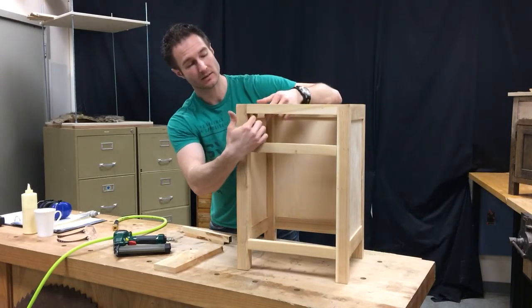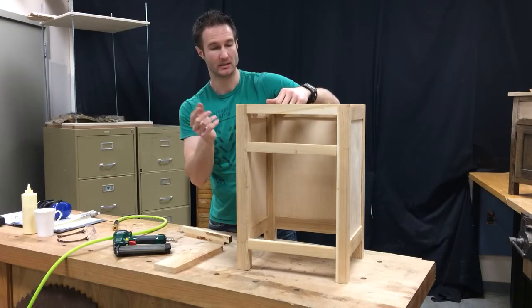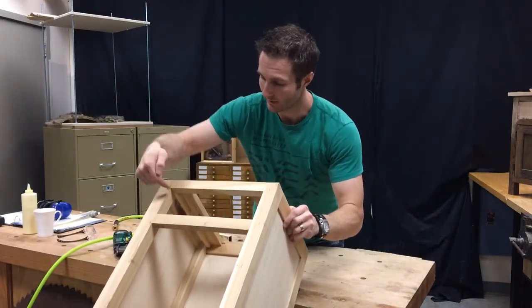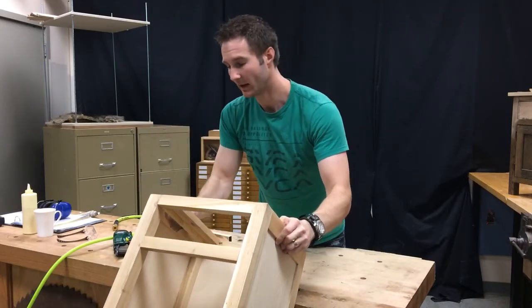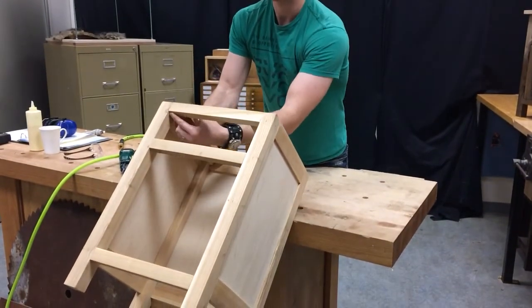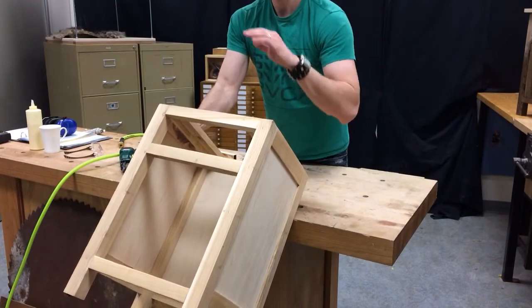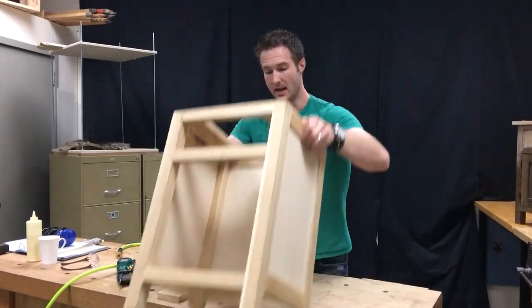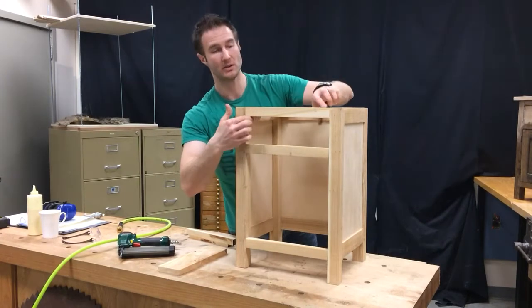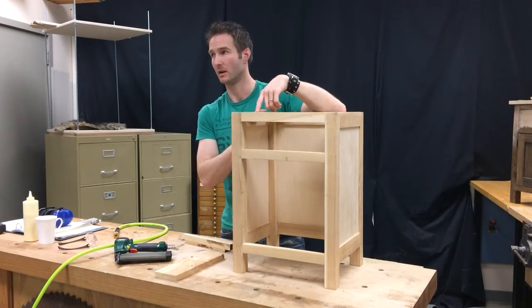We need to make a little spacer underneath here. The dimensions aren't actually in your books or on your cut list, but all we're doing is creating a spacer underneath each top drawer guide. They are about three-quarters of an inch wide, and the thickness is whatever it takes to get flush with the bottom of the front rail. They're glued right up against the leg. These two little spacers provide a rubbing surface for where the drawer is actually going to ride, and they prevent the drawer from falling down as it gets pulled out. They're custom thickness to whatever yours requires, glued in just underneath the top drawer guides.